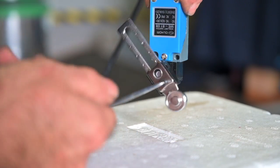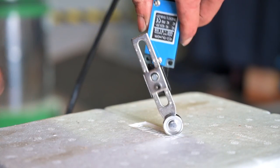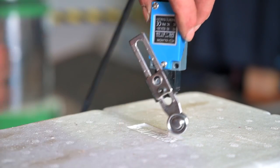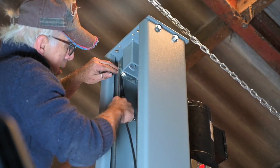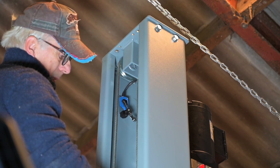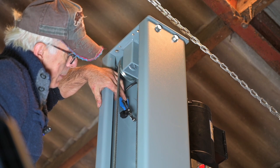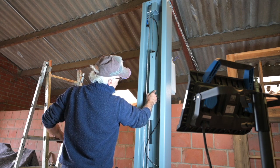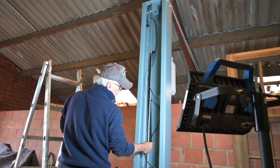We may have to extend this arm as well using this little screw. Once you can see the switch is sitting in the proper position it will flip up as soon as the lift comes up. Remove the shields so you can run the cable inside and then feed it through the hole back to the control panel. Now that we have all the mechanical parts installed and don't need to mess around inside the columns anymore, we can grease the steel cables.